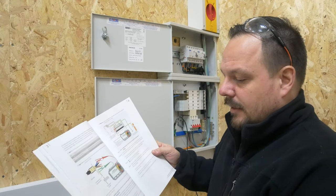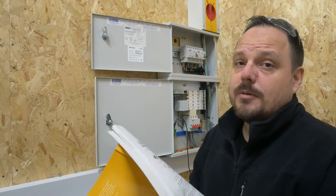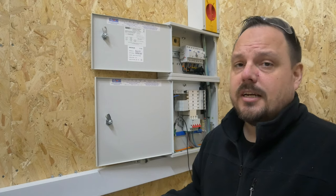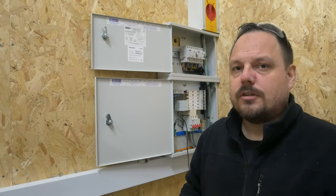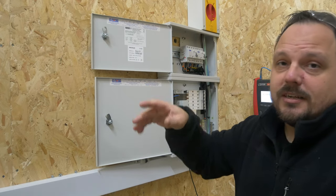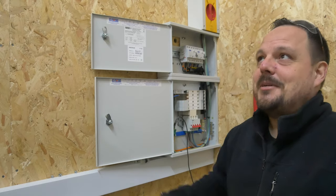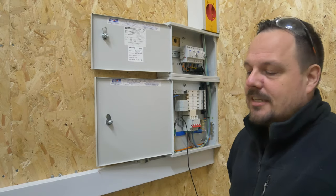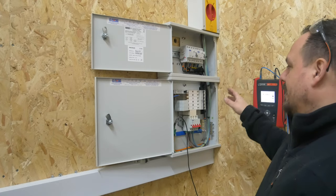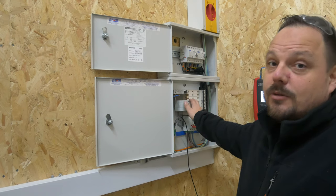It talks about here looking at stuff that can be damaged during your insulation resistance test, so you need to be mindful of that — things like AFDDs, surge protectors, any contactors, digital controls. With this, we do have an SPD at the origin, but I've turned it off — it's on an MCB at the minute. The whole installation is isolated so there's no great dramas. So that's isolated at present and we can make sure we're not getting any spurious values or damaging anything.